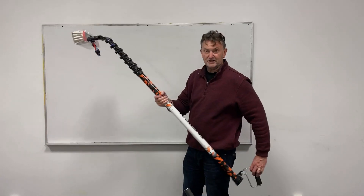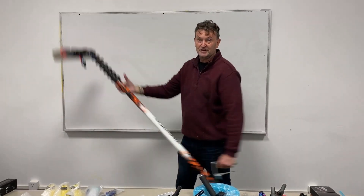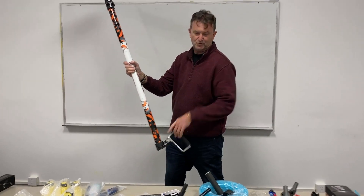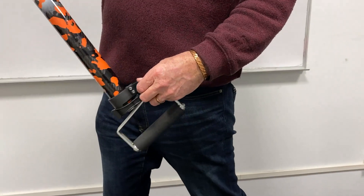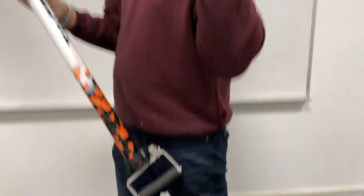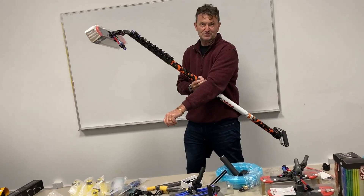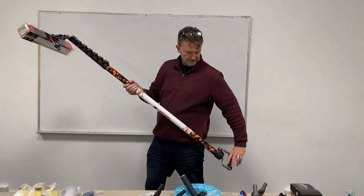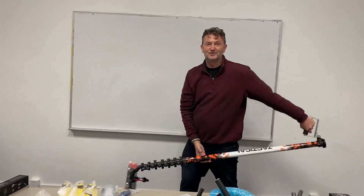All the movement is being taken up between this point and this point. That's pivot point one — the brush pivot — and pivot point two is the shoulder. When doing it the normal way, pivot point one is the wrist and pivot point two is the elbow, and the shoulder really doesn't move very much at all. So you compare that to this — it looks way easier and more natural. But if you're doing a house with lots of up-down movement it might not be worth it, though for a business park, school, university, commercial building, high work especially extreme work — you're just working like this.